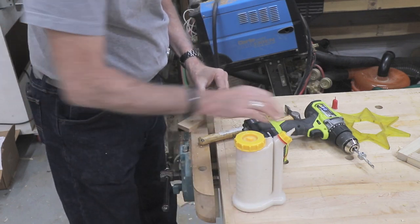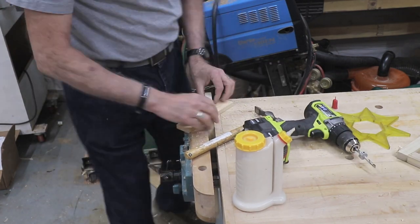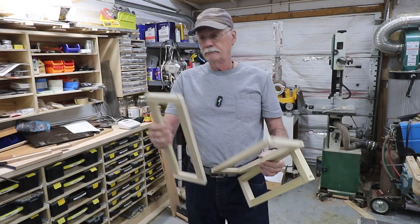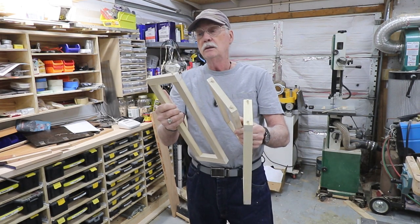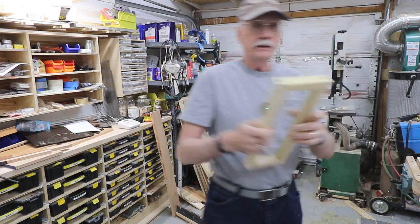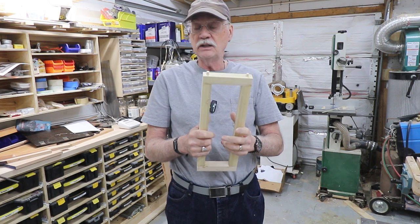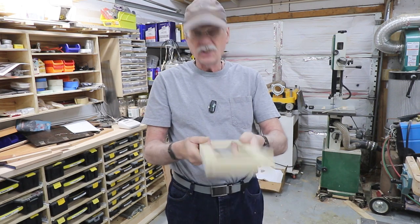Here are the finished three divider parts for the drawers to ride on, stacked up with the other pieces I'll have to make. What I just did was put the dowels in. The originals actually have a dowel as part of the joint, so I added that for a little added strength — although there's no load on these. They're basically just going to sit there and hold a little tiny drawer and that's it, but in the interest of consistency.